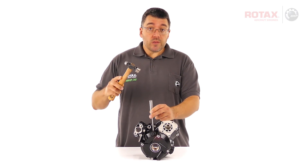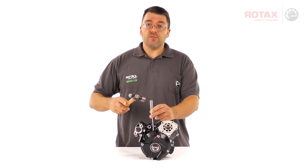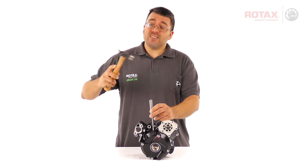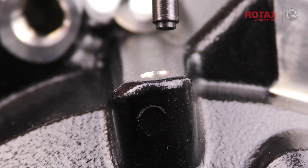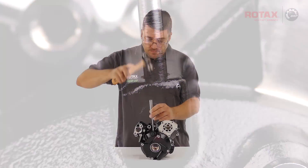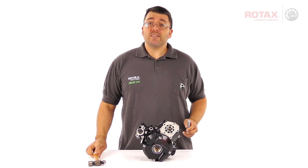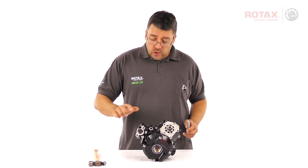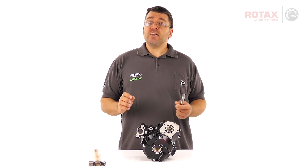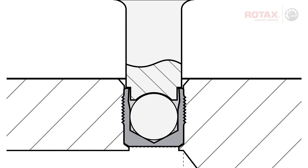Try a test blow with a hammer using only enough force to press the ball below the height of the sleeve. Don't use excessive force and ensure that the insertion tool remains centered on the sealing plug. Continue to gently tap the insertion tool until the top of the ball is below the height of the sleeve. This setting process expands the sealing plug as designed and creates a permanent seal.